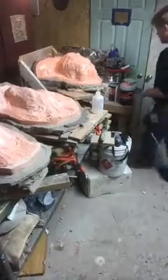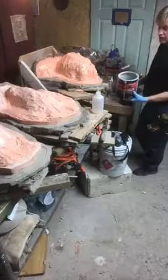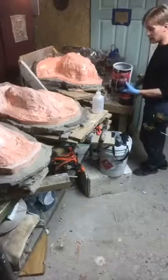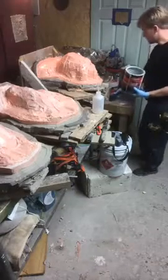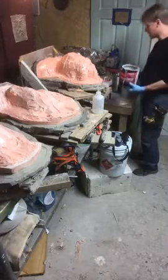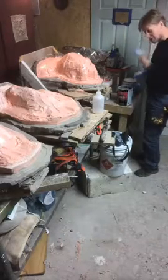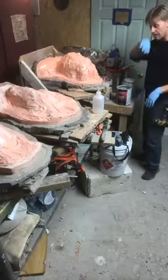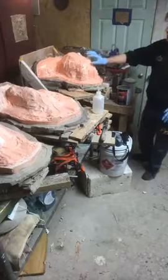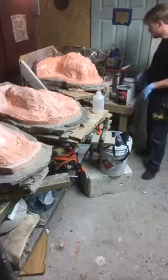Anytime we need it. So I've got enough that I've already mixed. Generally we'll take a half a can of Bondo and just pre-mix the whole can with the resin. So we got a batch. And then when you need more, you have an extra can from last time and you pour it half and then you got 2 more cans. And you just keep mixing it up. This stuff's not the cheapest way to do it. Again, beauty coat's not really needed, but if you're doing glass, it just makes your life a lot easier.